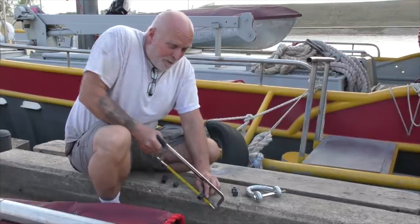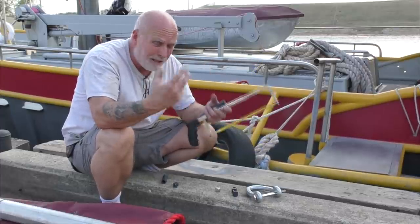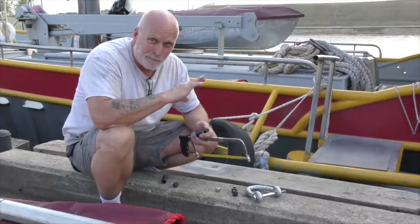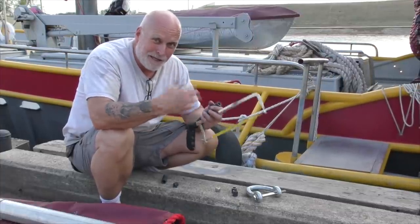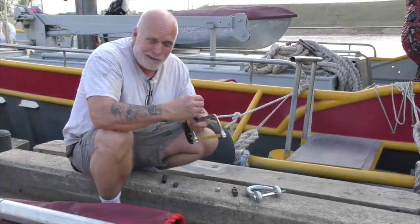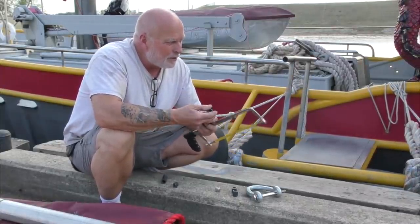A lot of you have mentioned spreader bars, and spreader bars is what we're going to do. There'll be a bar that we put across from one side to the other and then hook right in the middle, and that'll let us lift the boat up a lot higher against the davits. But that'll be something we do for transit when we're going to move for a while. These rope hangers are a lot easier to work with and they don't swing around and hit you in the head like a bar would, so they're good for when we're in harbor or someplace where we're going to have the boat in and out a lot.